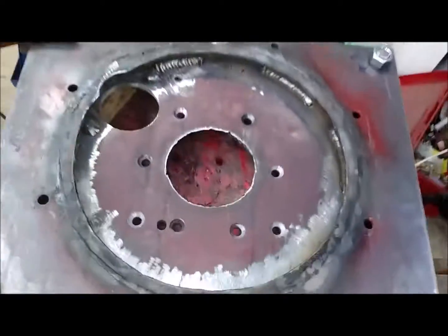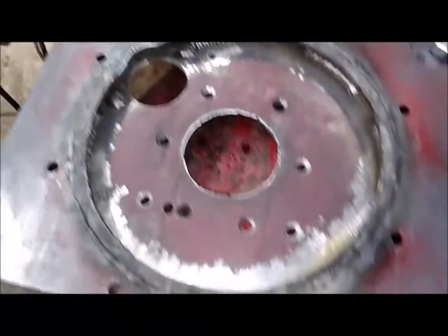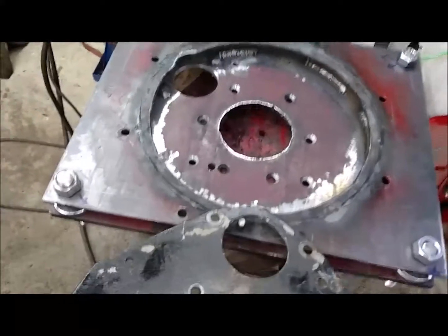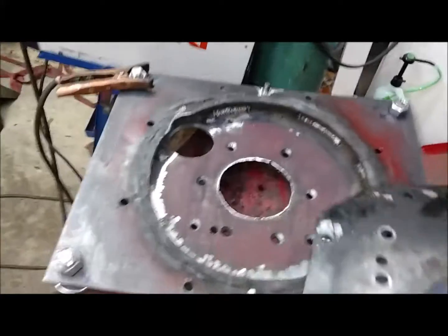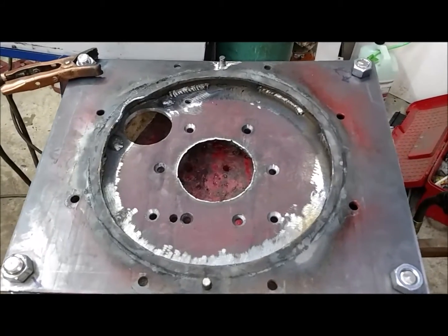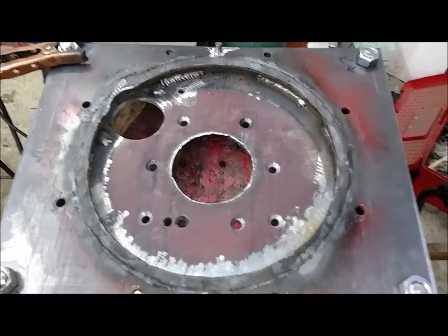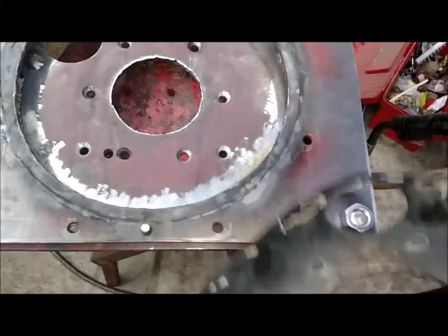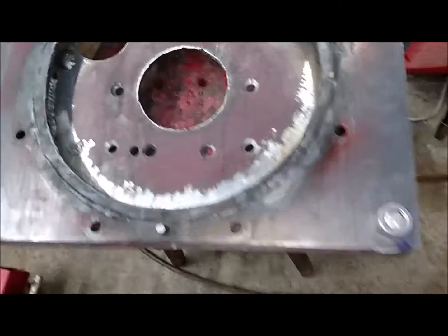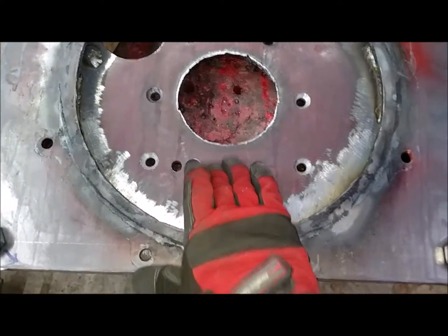So we've got some plates here — let my welder cool down. Pretty simple operation really. The big hole is SAE 5, typical standard — you can pull the dimensions right off the internet. These two big plates were the same size, length and width. We have a quarter inch and then three-eighths down below that goes up against the engine.